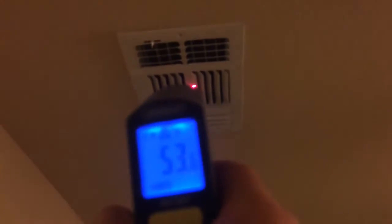For the first test, you're going to take the temperature gun and measure the return air. This is where the filter is typically in a house — it can be on the floor, near the ground, or it can be up in the ceiling. Just take the temperature reading here, and then head on over to a supply vent and take a temperature reading there.